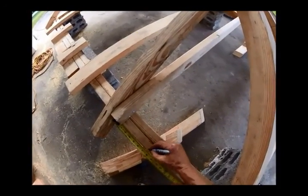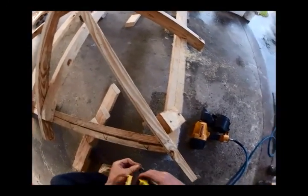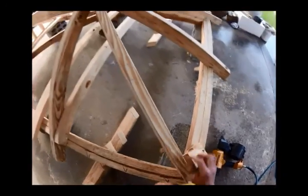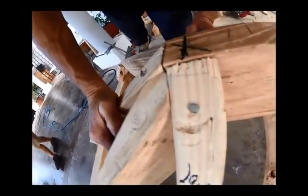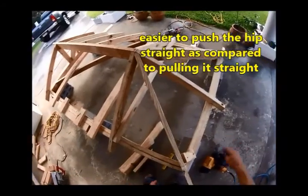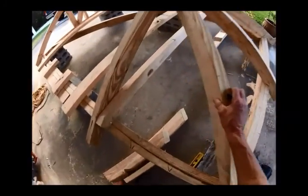I'm going to butt the common rafter — so I'm just going to be there and back: sixteen, and back, twenty-four, right here, and back. You'll notice I put a block in here to plumb this guy up, get it nice and level — and you'll see it's nice and level, nice and plumb. I should look from the top down — you look pretty straight on this guy. It's nice if you can think about running the bow out one way or the other. It's a lot easier to push it, so if you're stacking left and right side and it's kind of bowed a little this way, start on this side, because then you can push it back to straight with your first one, rather than starting where the curve is. It's easier to start on that side.